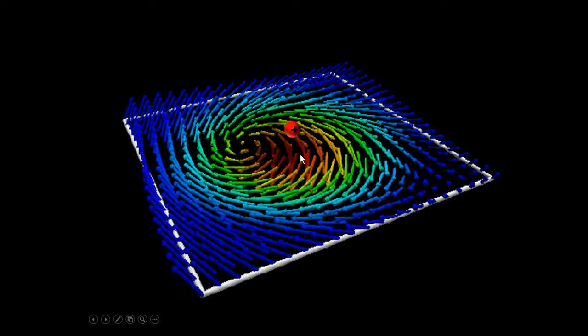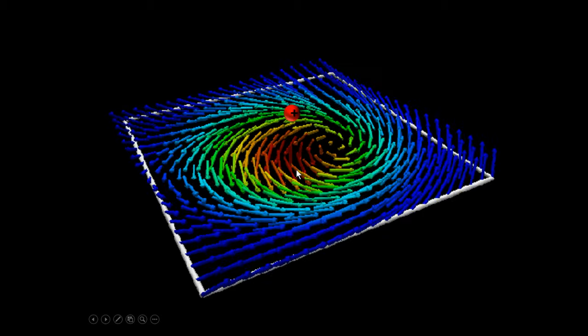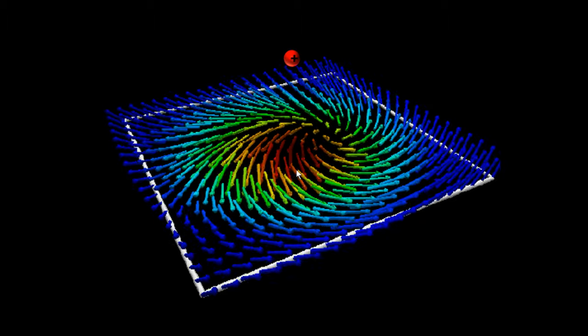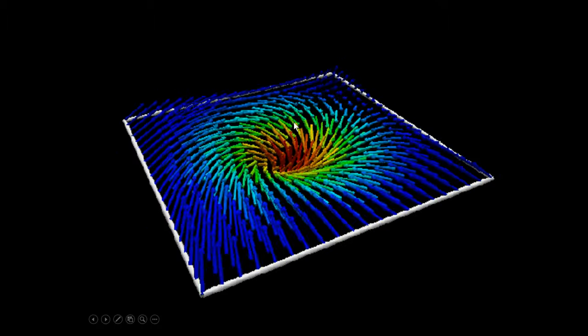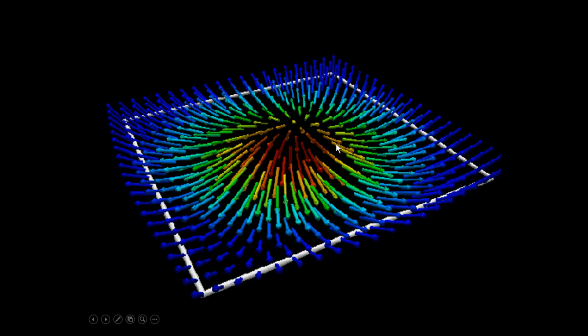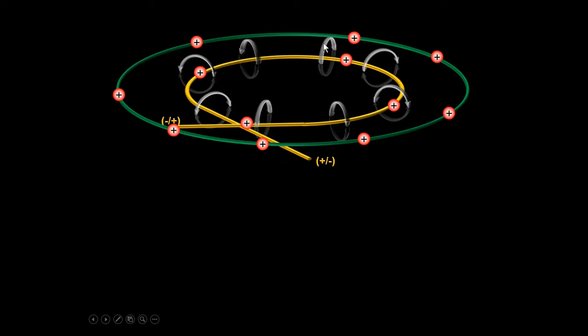And one thing to understand is that when the charge is moving slow, there's a small magnetic field. And when the charge is going fast, the magnetic field is stronger. So right at the top, it's slowing down, stopping, turning around, and going faster. So when these charges are going back and forth, the magnetic field in the center is going up and down, the magnetic field on the outside is going down and up, but if we had a second coil of wire all the way around that, the charges that are in that are going to be in a changing magnetic field.